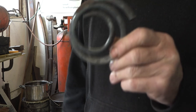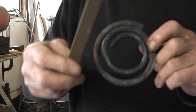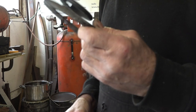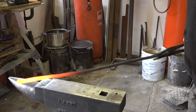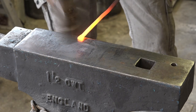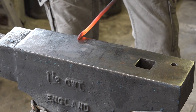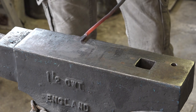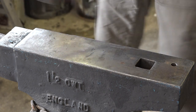So let's get into this. I'm going to use the top of this old car spring because it's a small section — there's not as much metal to move, it'll be a pretty quick task. You could use anything like an old file or an old knife if you're forging. First job is just to get it in, straighten it out, and then just beat it. It's surprising how much steel you get from a little piece of spring like that — it's almost the length of my anvil.